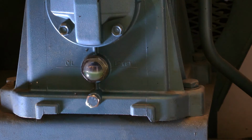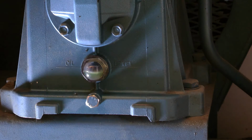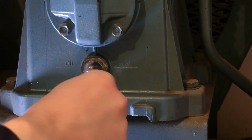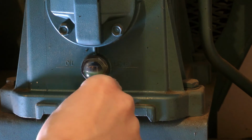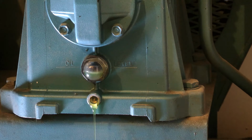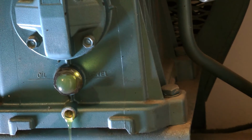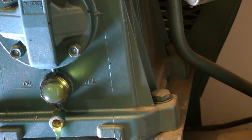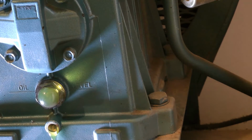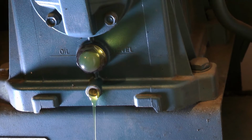And before I do that, thinking about it, instead of getting plenty of mess, I'm going to put a couple of bits of paper under it. Always keep old newspapers, you're going to need them. There we go, right. Just loosen it. There's a little washer on there you're going to take off as well. So what I'm going to do now is tilt the compressor slightly, and now I'm going to take the top off. And you can see the oil draining out.